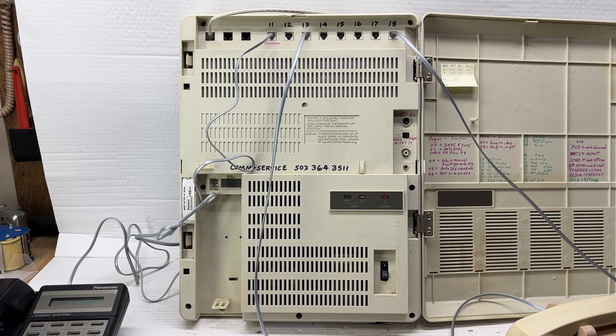This particular unit is a Panasonic 308 system. They made a 616 system as well as an 824 and so on. The 308 and the 616 are both the same exact identical package. The only difference with the unit we have here is three telephone lines — the jacks up on the upper left — and then eight extension or station jacks. A 616 would have 16 jacks across the top and six telephone lines referred to as central office lines. The cabinets are the same exact size, almost the same weight, and they operate the same — it's just twice the capacity.